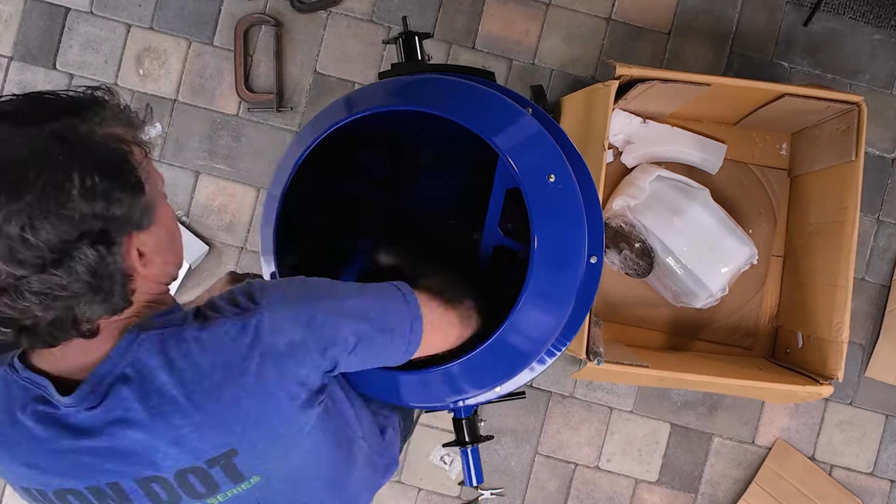Step G. The locking plate. Slide the locking plate over the large diameter shaft with the rim facing inwards. Insert two bolts, tighten with a flat washer, lock washer, and a nut.